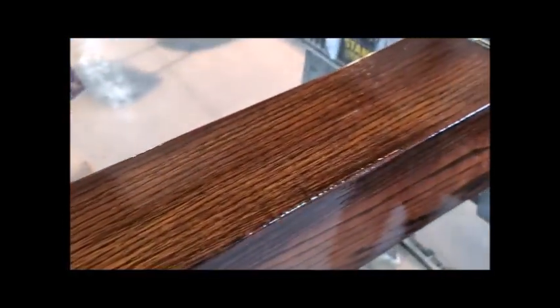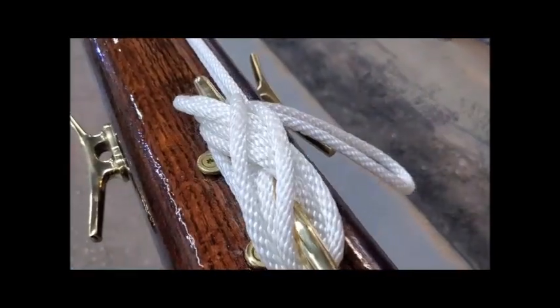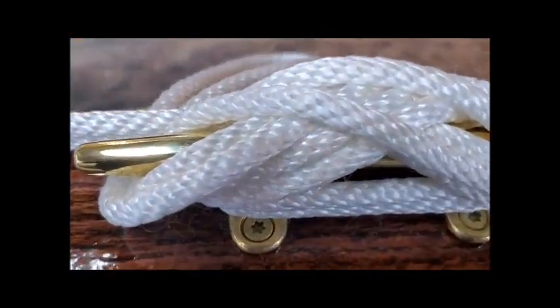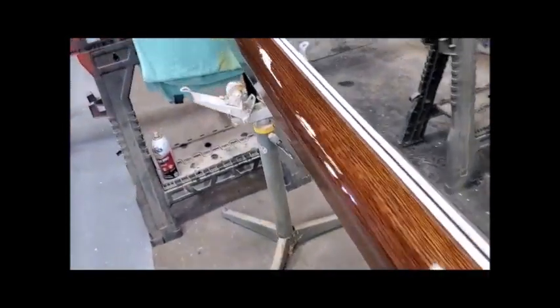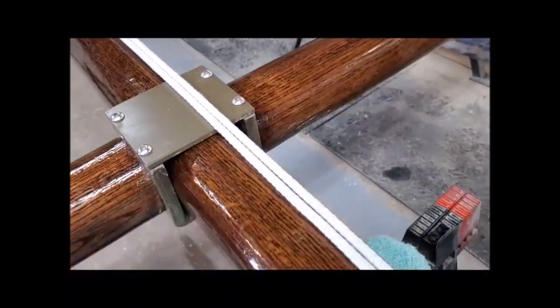The mounting pin is at 24 inches up on the base. You'll be setting the pole on sawhorses and raising it right into the mounting base from immediately adjacent to it. The final consideration is where the cleat goes — up, as we have it, or down. As far as the yard arm is concerned, cleat up is easier because once the yard arm is in place with the plate on top, it works well.